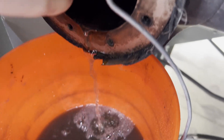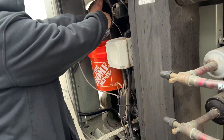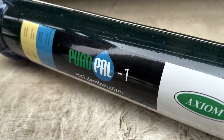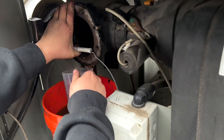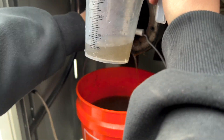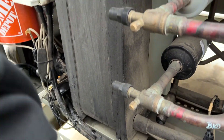Running clear now, but look at all that came out of here. We are flowing through with demineralized water. Look at these resin beads — we're still getting clearer and clearer, but yeah, there was a lot of garbage in that exchanger.